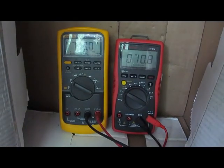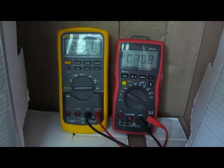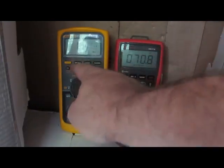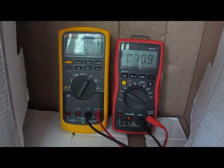Okay, let's functional test it. Obviously the DC voltage here is still fine. It's about right, 260 volts. Let's try it in ohms. This is a 50 ohm, about right, 100 ohm, looks good, 100K, it's fine, 10 meg, looks fine. Let's put it in capacitance mode. This is 100 nanofarad. About right. And we'll try it in diode check mode. No problem. So there you go.